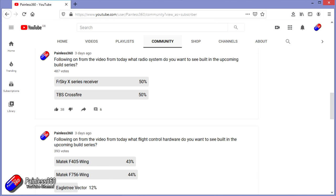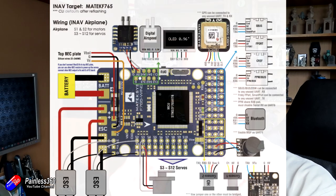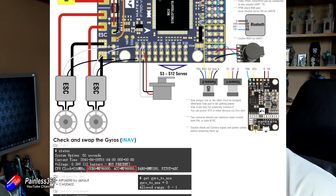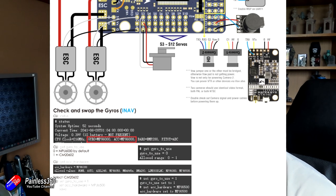And that brings me back to the flight controller choice. The next video is going to be all about the flight controller. At the moment the F765 is the one with the majority of votes. It has some additional features over the F405 - specifically, the ability to connect two cameras and switch between them in iNav, which could be fun to have like a camera looking back over the model and a camera looking out the nose. Whichever wins, I am absolutely going to do a video on the F765 with iNav to show everybody how you set all of that up.